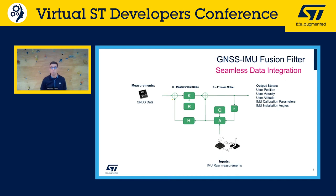So from the very first power up of an ECU, for example, in a brand new car, the IMU is mounted however the design dictated. And the gravity vector is quickly determined while the vehicle is static and positioned on the road, so that the orientation of the three axes of both the gyro and accelerometer become known with respect to gravity in that vehicle, supporting the subsequent DR computations. And after some initial driving, the coarse initial calibration is refined for the gyro by executing some turns, which is what helps us dial in the yaw parameters, and for the accelerometer by executing some straight driving and dialing in an accurate linear displacement calculation of distance traveled.